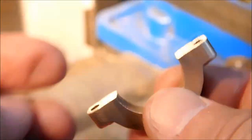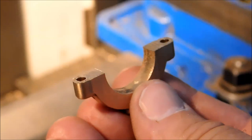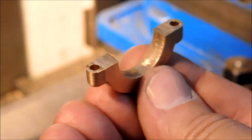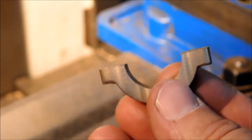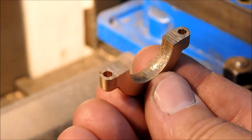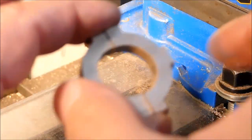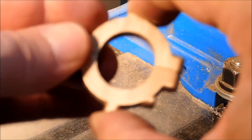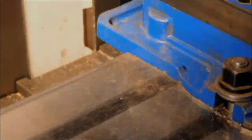Not to worry. I'm going to sit it in the vise this way. I'm going to deck it off to exactly 60 thousandths of an inch below each half value that I came up with before. You saw me set it up with the parallel and the gauge block. Well, this is where the rubber meets the road. I'm going to go 60 thou below the line, 60 thou above the line. And knowing those two numbers, I'll know how big this part should be to come up with a true split line in the center. Then I'll bore it.